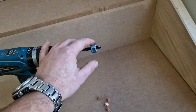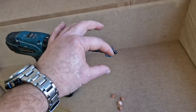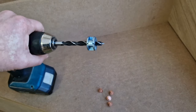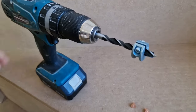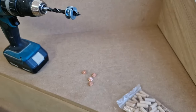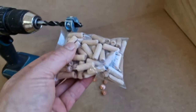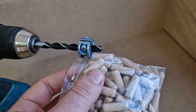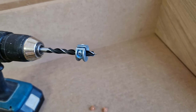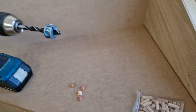We've got that drill bit and the collar available on our website, along with these pins. You set that ring with an Allen key to secure it. Our dowel set - the dowels are 25mm long. You would set the drill depth to a little bit more than half: if the dowel is 25mm, I would recommend setting the drilling at around 13 to 14mm - so it's a little bit more than half of the dowel.